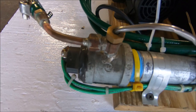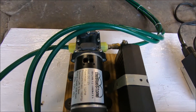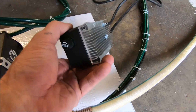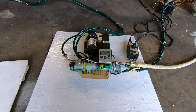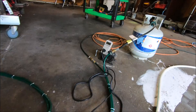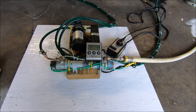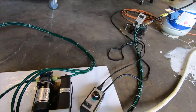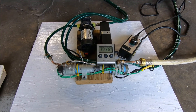We have our garden hose and the discharge, which is equipped with a thermocouple connected to this 160 PSI pump. The power output of this inline heater is controlled by this triac circuit — this is just a breadboard configuration to see how things work. Eventually it will all be boxed up along with the power output meter so everything is contained. I just want to look at its performance today and see how much more power we can crank into this thing. We're low on propane but I think we've got enough to get the experiment started.